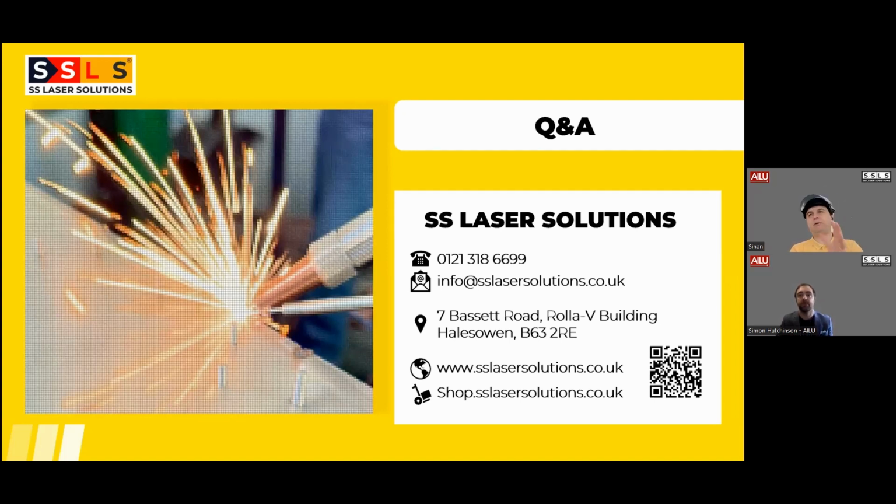First, the very easy one: when you set your parameters, let's say your power is 700 watts, 800 watts, and you know how it welds. Within a second of starting, first you will get a good amount of power and it will immediately reduce. This will happen within a second. That's the best sign to understand there is an optical damage.